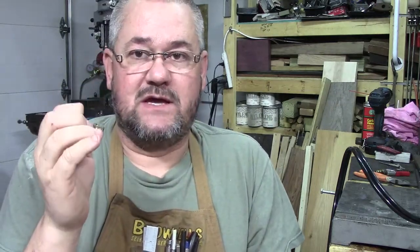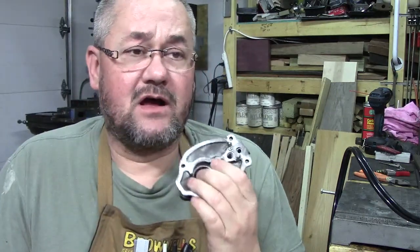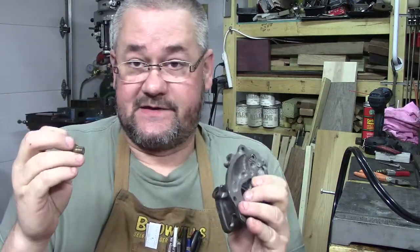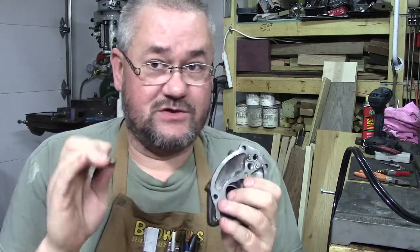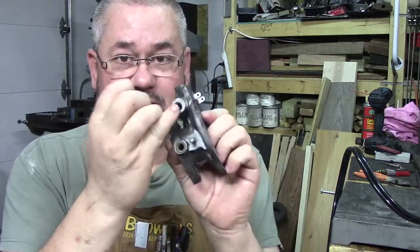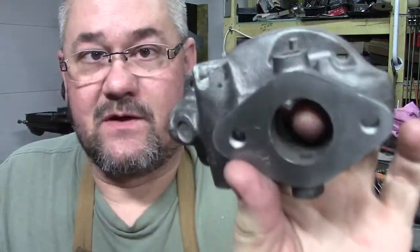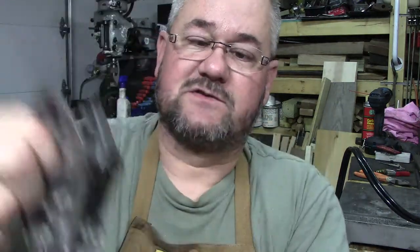Yes, it's not going to be all the correct taper, but we're not relying on just the fit and the exact, perfect taper to fit things up, because we've already gone in with a tap just to clear the threads out and see what damage is in there. Now, obviously we can see where the repair is. All that's going to come out, okay? And in the process, I know it's not going to show up on camera, but in this area up in here, it's also split back just about as far as you see this.